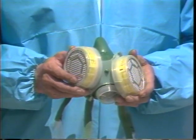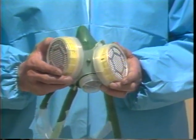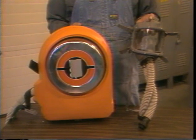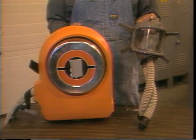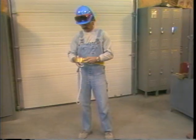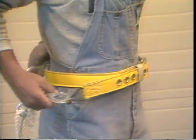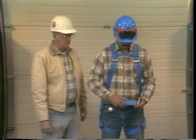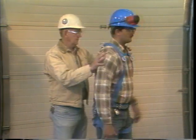When toxic substances are present, special air monitoring equipment must be available. If all other measures fail to provide proper ventilation, crew members who may be exposed must wear respiratory devices which can protect them from toxic substances. In some cases, self-contained breathing apparatus or supplied air respirators may be required. Each employee entering the mill must wear a safety belt that can be attached to the tag line. A safety harness must be available for emergency rescue in the event a worker is injured and must be lifted out of the mill.